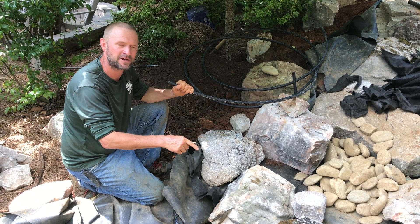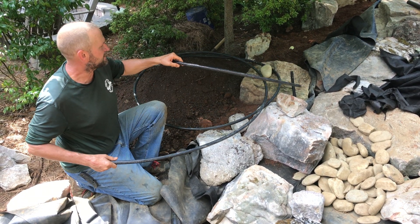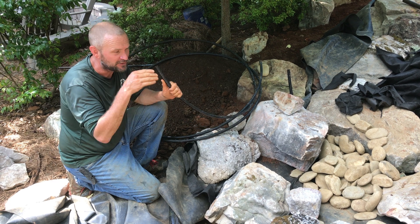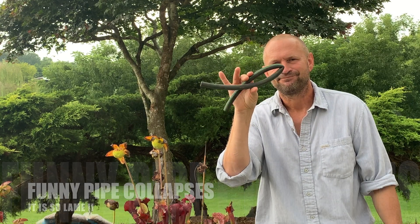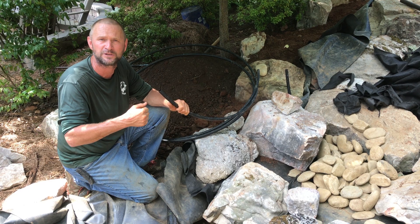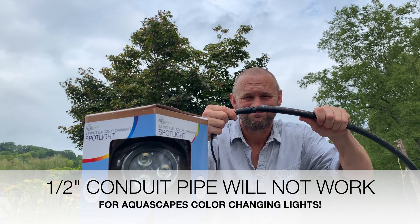You see a lot of guys run their wires right in between the rocks, foam stuff in, build over top of it — and when it comes time to replace a light fixture, it's a royal pain. I use 160 PSI thick-wall pipe. A lot of other guys have started using conduit methodology but they use funny pipe. If you crimp it, you can't use it, because you need to pull stuff through. Funny pipe almost always gets crushed when you backfill gravel or put boulders on top, and then when it's time to pull your new light through, you can't get it through — the whole thing is a waste of time. Use thick-wall pipe. If you're using color-changing lights, you need an even bigger pipe to accommodate the larger wire and connectors.